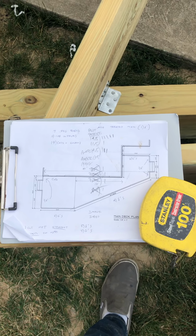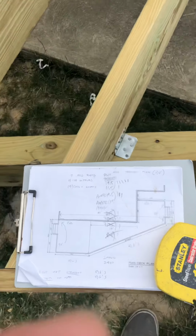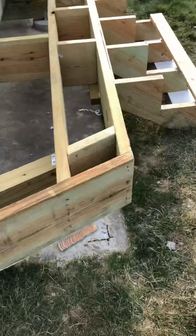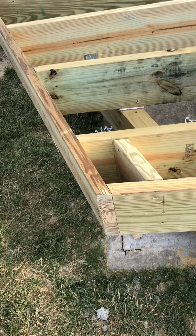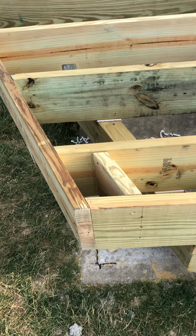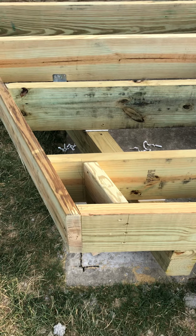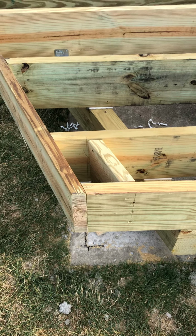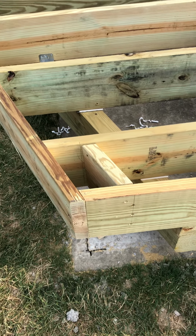This video is for a framing inspection for 9415 Ravinia. Just to start with the footprint of the deck, because of the easement, this was determined to be the spot where we would come out right where the concrete pad was. Technically, by the topographic survey, the concrete pad was within the easement. So I'm just back a hair. Once my fascia board and nosing of the decking are on, will be right there.